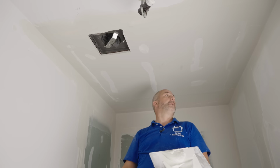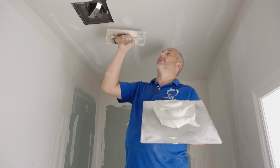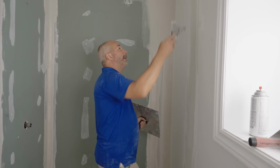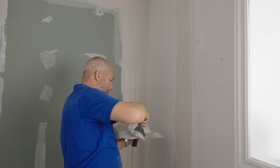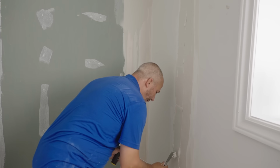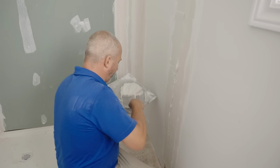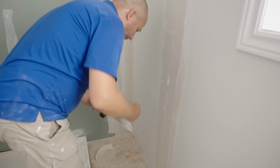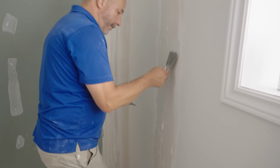All right, done. That's just the second coat. When we come back the next time, I'll be able to pull this out a little wider on both sides and make it incredibly smooth and easy to sand. Okay, now we're back to finishing off taping this. And it's okay if you've got mud in between your drywall and your tape. All right, don't worry about that, especially when it's a hardener. There we go. And especially when you're using hand tools and you're embedding the tape.